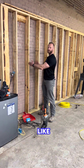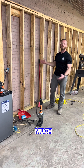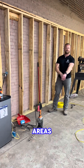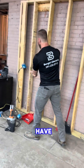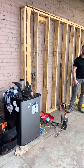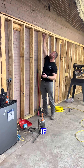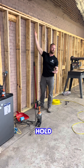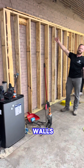Or what we do is just go up and over. If it's like triple stacked studs, typically we'll go up in the attic or above or below and just go around and drop it in. It's much cheaper and more efficient to go up and over than to drill through four or five different studs. Imagine drywall being on this wall — sometimes we have to cut out a lot of drywall just to get our holes drilled. We try to take out as little as possible, but sometimes it's just impossible to feed wires through a stud wall with a ceiling and drywall on the side. Especially on outside walls, you've got your rafters coming in.